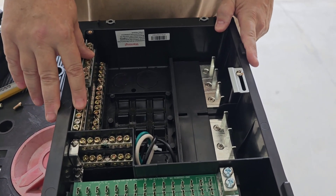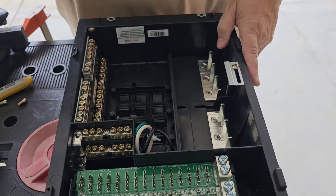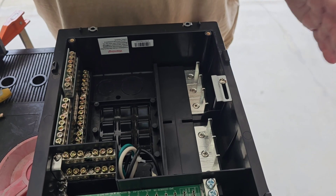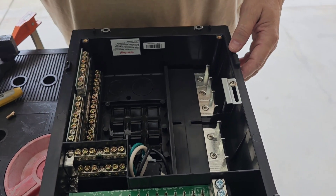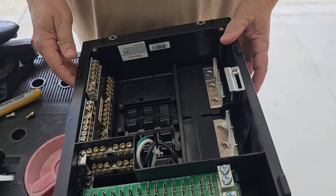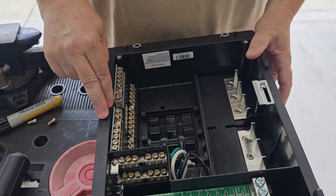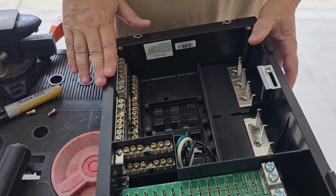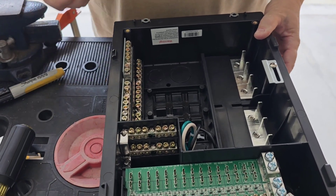The automatic transfer switch within the inverter keeps this bus safe. So if you have a Unity 2016 through 2019, you can make this simple modification to the power distribution center you already have. If you have an older Wunder or older than 2016 Unity, I recommend replacing the single 30 amp power distribution center with the WFCO 8930/50 and do this modification so you can use it to wire in a 3000 watt inverter. I'll show you how this all gets wired when I replace it in the 2018 Wunder.